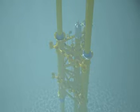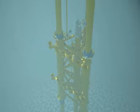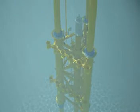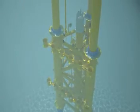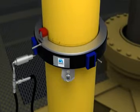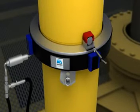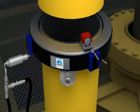Once at depth, the conductors are grouted into the subsea structure, using a recipe that's been specially formulated and extensively tested to utilize standard oil field ingredients. Grouting for a three-leg C-Swift takes about 4 hours using a standard rig cement spread. Each conductor is cold cut to the correct height using Aquaterra Energy's highly accurate SureCut system. A 30-inch diameter, 1.5-inch thick conductor typically takes 45 minutes.